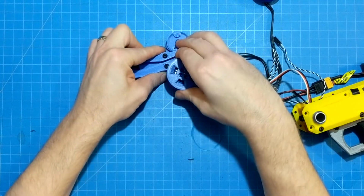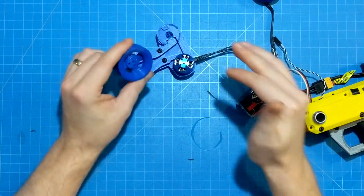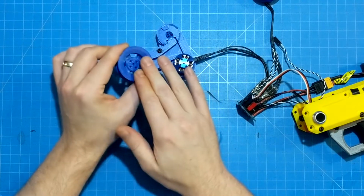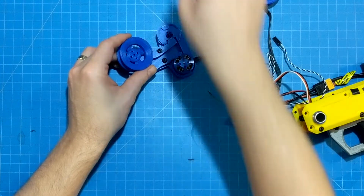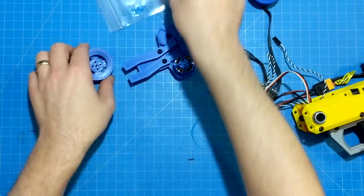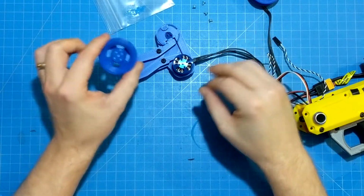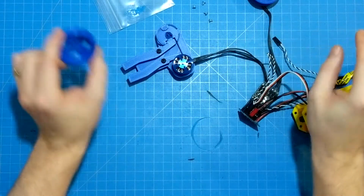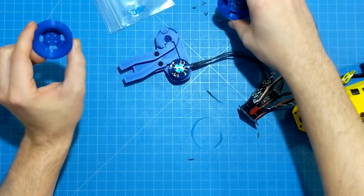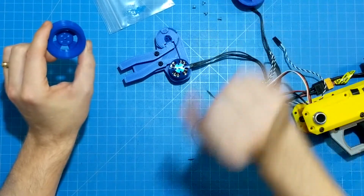Now, here's a concept that's pretty important too. When you're balancing your flywheel, you are not only balancing the flywheel itself, you are actually balancing the flywheel and the bell of the motor and the screws and the Loctite. All of that makes up a unit that has a certain amount of mass, and some of that mass can get out of balance in one way or another. You'll notice that this one that was balanced, I haven't taken off of the motor. I will leave it on the motor now that it's balanced because it's balanced as a unit with the motor.